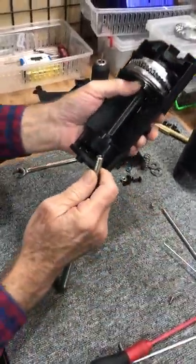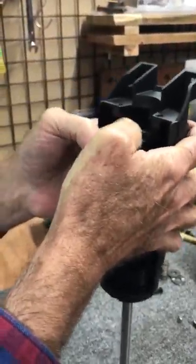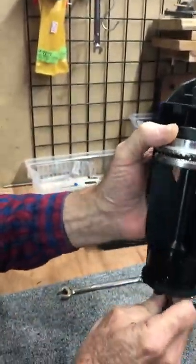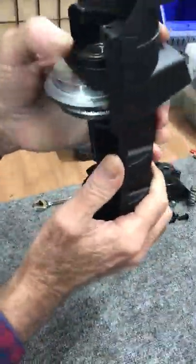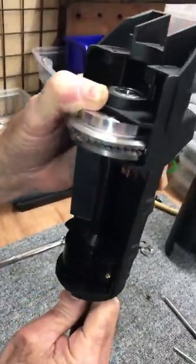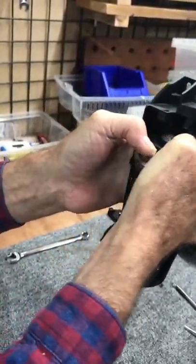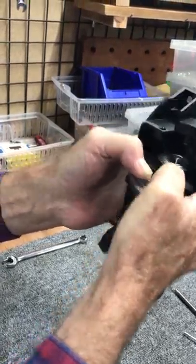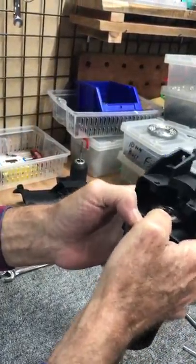Now, getting the axle in, I get it started on this end and make sure it's gone through that first bearing. Now, once again, I take my thumbs and get the burr in the right place. Tell you what happened here. I have to check and make sure. Okay, you have to look in here and make sure your thrust washer's in the right place. Okay, get this started. There it goes. I'm holding this in position. Holding the rotating burr down onto the stationary burr. And once again, I turn this into the fine position. It's a little easier. Okay.